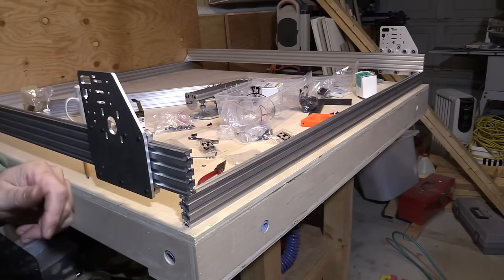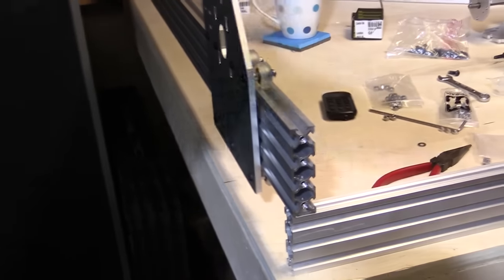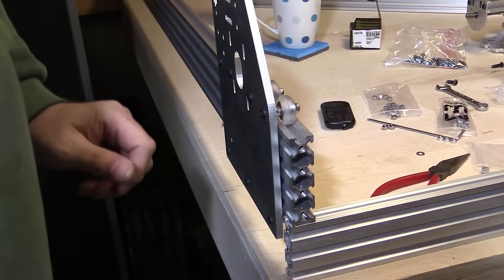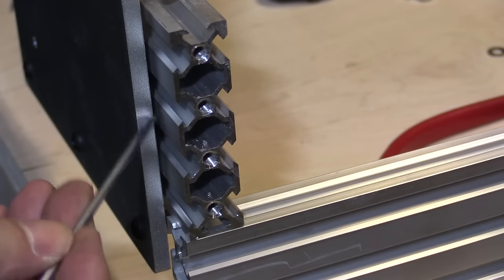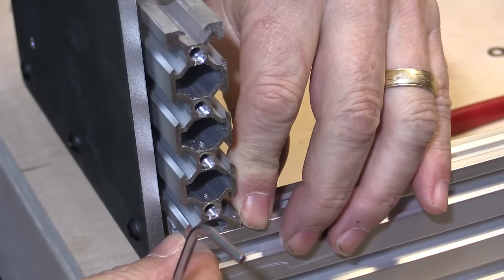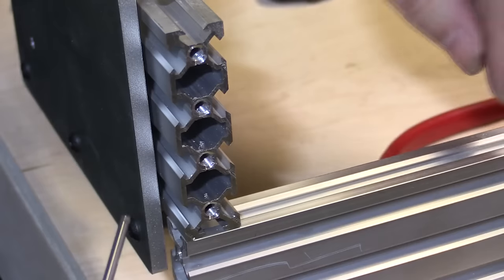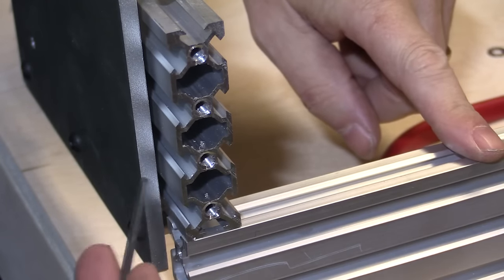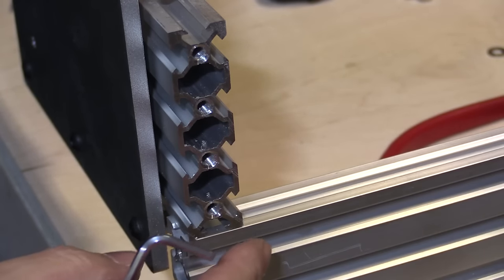If you look very closely at the end here — when I bring this wheel right up to the end — you'll see that the gantry is going to be connected to the inner surface of this plate. If we have this exactly flush, that's a few more millimeters before you hit the plate. So if my gantry width is the same width as these rails, it's not going to work and it's going to try to twist things in, which we don't want. We want to have it as naturally positioned as possible.